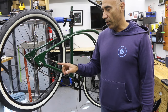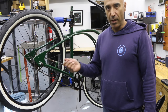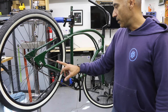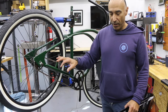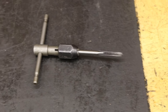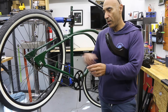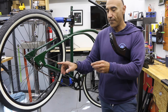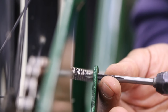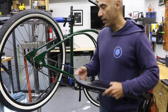If you try and force it or if you're impatient, you could actually mess up the threads because of all that dirt. You're going to come in crooked, and you're going to start stripping either the screw or the threads. You don't want to screw these up, but there is some cleaning up we can do. If you mess up the first thread or two, we can still use the tap here to clean that up. These are designed to clean up situations where the first couple of threads are messed up. It's tapered, so it's going to go in, bypass the messed-up threads, catch onto some good threads, and clean it up — and that can be pretty common when you're trying to get something started.